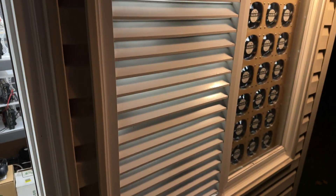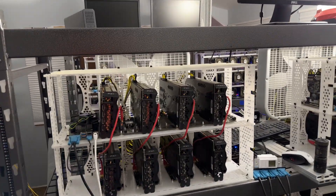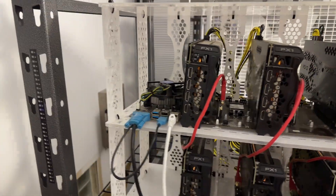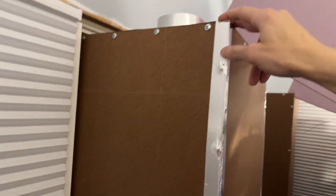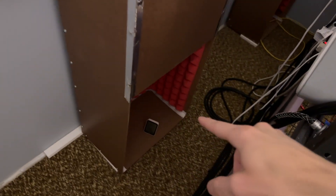You can see the backside of this louver is just open. This louver is in the way, impeding airflow, but it's there just to minimize rain ingress — and it works well for that. It does mean there's more pressure required to push air out. The other side — the intakes — also have two louvers on them, plus screens on the inside and big filter boxes that redirect the air down into the intake. Those filter boxes are stuffed with foam. There are two of them — that's the full airflow setup.